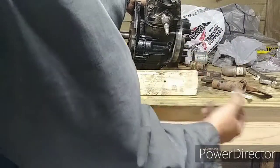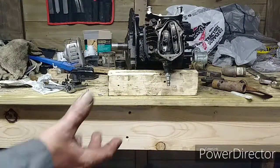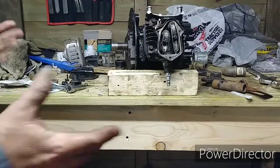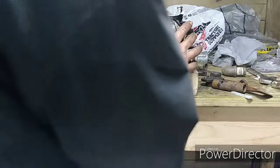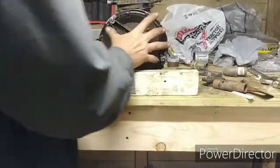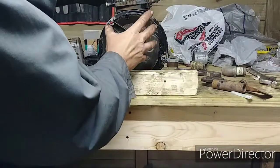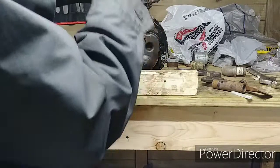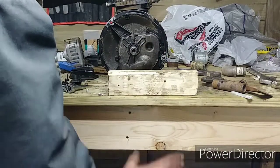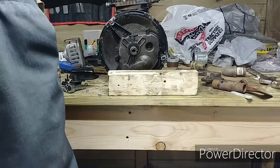If I can get it to operate on lower PSI, that'd be great, but it could still be fighting some resistance where the valves aren't quite opening right. We'll play with the timing. Otherwise I've got a reason to buy a new compressor. This thing will actually run better once we get some type of flywheel mounted on it. It's got some weight, and that weight will help move things around and drive a hammer up and down. So that's the idea right now.